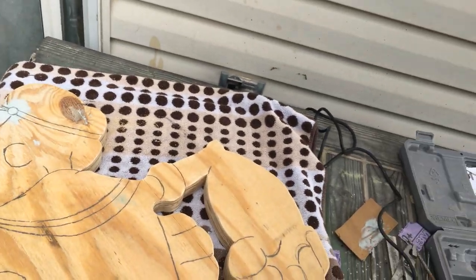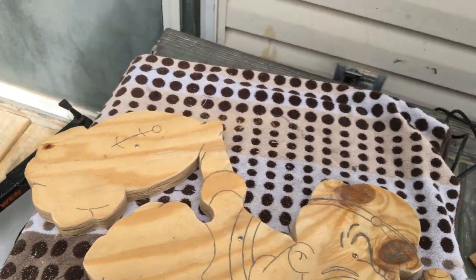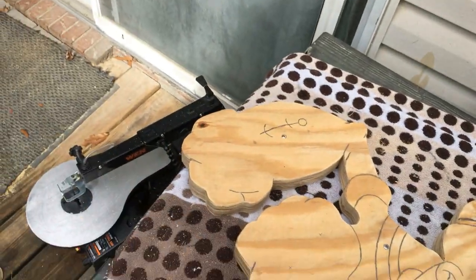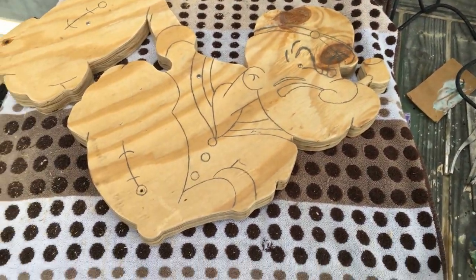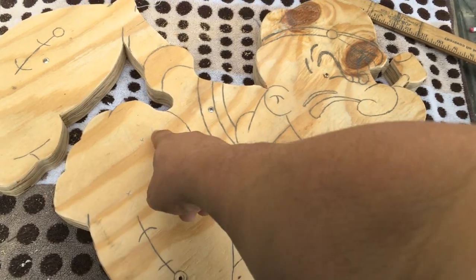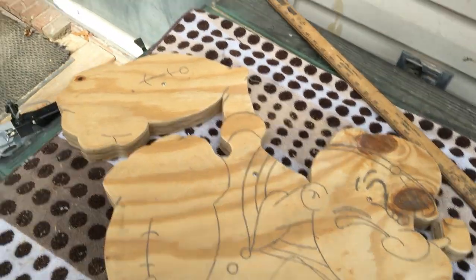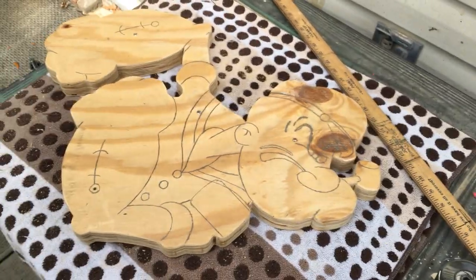But alright, so next step is to turn it over and then draw out where the neck pocket's gonna go, and then actually get the scroll saw going and cut out the neck pocket. But alright, we'll see in a little bit. Alright, drawing out my neck pocket. I got the neck out and drew out the shape, and then my X's where the intonation line is going to be. So let me separate all three layers, get the scroll saw going, and then cut out the neck pocket, and we'll see you next up.